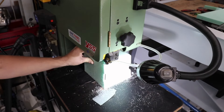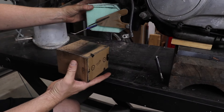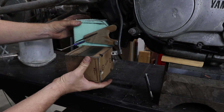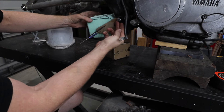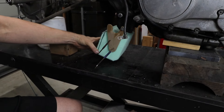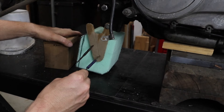The cardboard is representing the side bracket that I'm going to make. The battery will be laying down in that position, so the terminals will be here on the inside of the box. This long bolt will be the through bolt that goes all the way through this hole here, and when you release that bolt you'll be able to lower this down depending on the height of your bike. I'm still figuring it all out, but it'll allow you to get access to your terminals really easily.